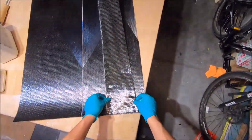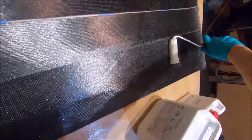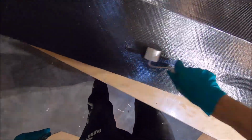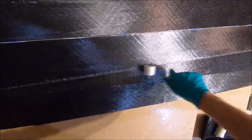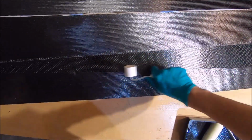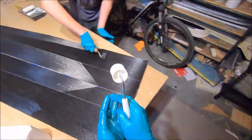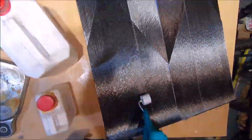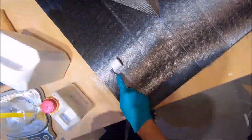So I'll just put this root in place. Squishing this uni especially out with a hard roller helps flatten it out and not be such a bump, and also helps spread out the fibres. It's like a wet sand cake, you squish it out to get it all meshing together. It also gives a good idea of how much resin's in there. You start feeling it.